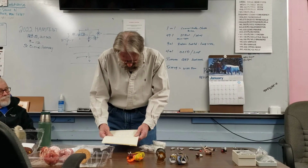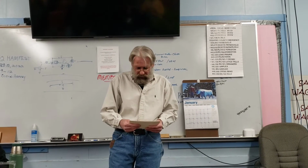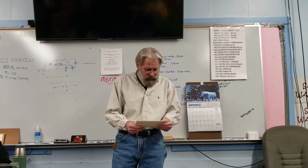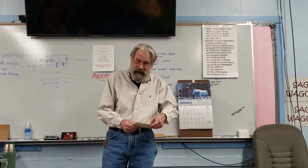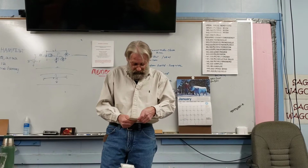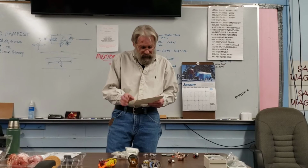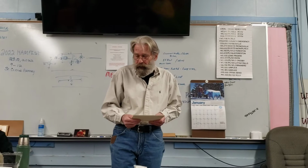And just an example, I'll read off a list of wire lengths that are usable on a 9-to-1 unun from 160 through 10. 53 feet, 59 feet, 72 feet, 88.5, 98.5, 124.5, and that one's got an asterisk by it. Apparently that's a really good length to have. 135, 146, 162, 175. Typical SWR on something like that is about 2.2-to-1.